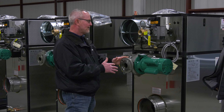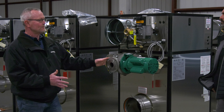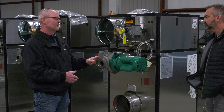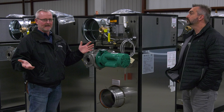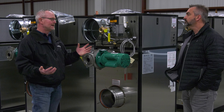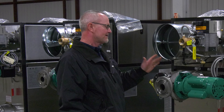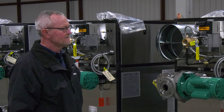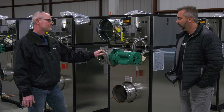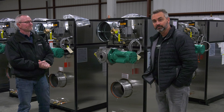That's the biggest thing — whether it's a rental or a permanent installation, it's the same issue. Make sure they don't have any mild steel. If they're going to rent one, ask a real simple question: is there any mild steel in your system? If everything is stainless steel, brass, or bronze, they're okay. If there's any mild steel, just stay away from it. Very good advice.